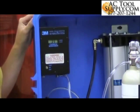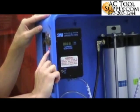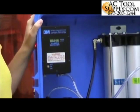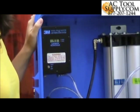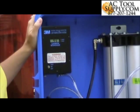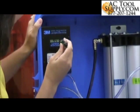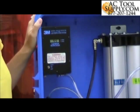There it goes — when it hit 10, I could hear and then see the red alarm light on the standard panel. And it goes rather quickly; I'm already at 83 parts per million. You just want to give it a little bit of time to make sure it's able to stabilize before you do any adjusting. I'm at 94 parts per million — I'm just going to adjust it by giving it just a slight turn so it's at 95 parts per million.